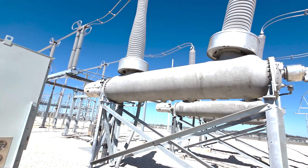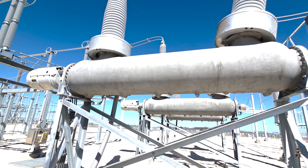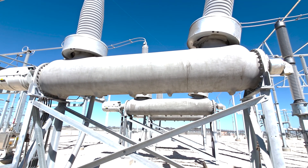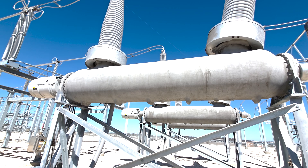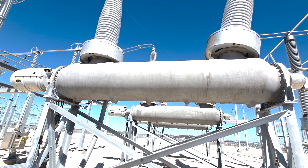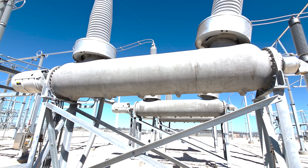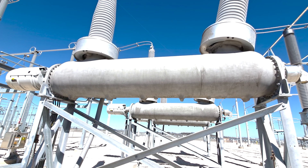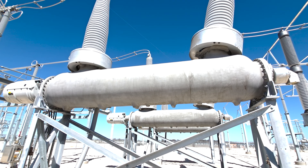The breaker essentially functions the same as the SF6 breakers. There's a rod in the middle and then a rod on the other side that's attached to a spring, and that spring will either pull that rod away or push it into the rod on the other side, so it just makes and breaks a connection. A little bit different theory with this though is that when this opens — the piston opens — it also sprays; it's called a puffer. The puffer is integrated in that piston and it sprays towards the arc, so as the rod opens and breaks that physical connection it also blows this C4FN gas mixture into that arc to extinguish it faster. The theory behind that is you get the arc put out faster and your contacts don't wear out as much and they will last longer. So that is one key difference.